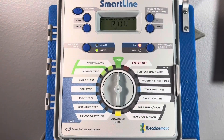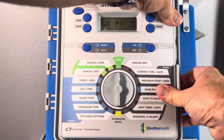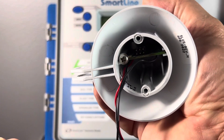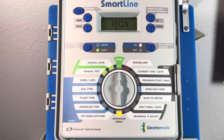I'm going to go ahead and release the switch and within a few seconds we go back to normal as indicated by the green LED. Now to finish this, we're simply going to insert the RJ11 adapter into the port to reconnect the air card at this time. Then once again, once the system boots, we're going to test the switch on the sensor one last time — press and hold the rain switch for 15 seconds. We have four green blinks; holding: LED indicates rain, LCD indicates rain. We have successfully eliminated the SLW error and restored communications to the panel through the SL hub as well as the air card.